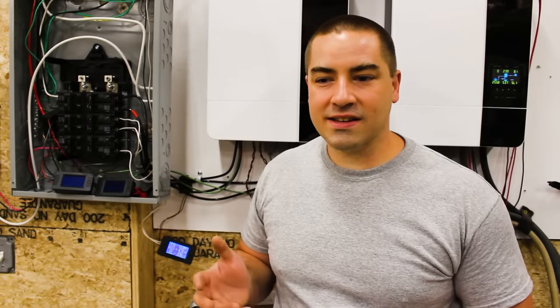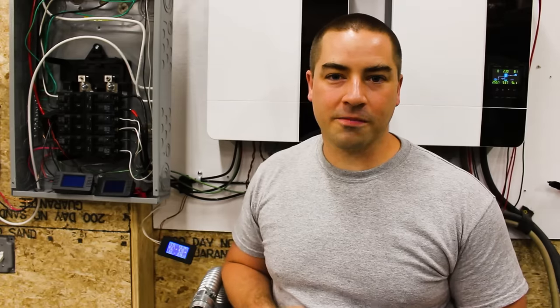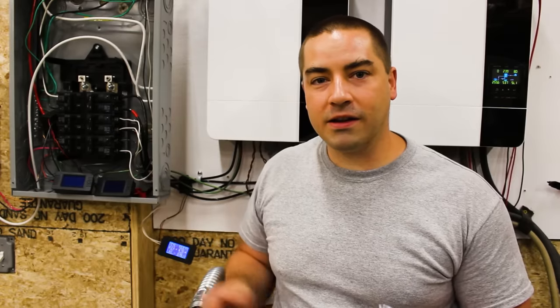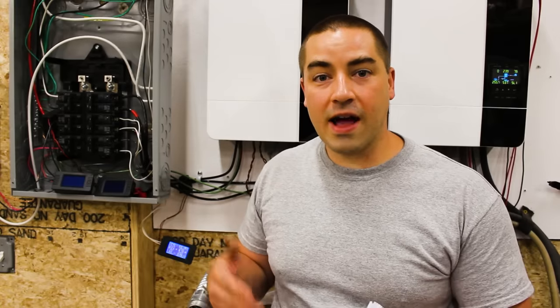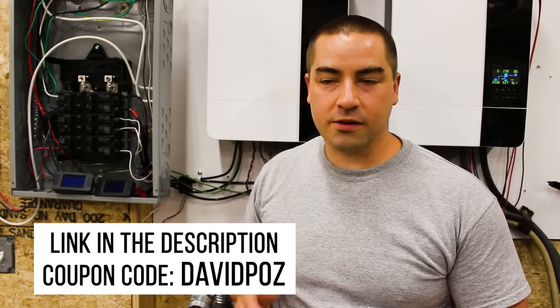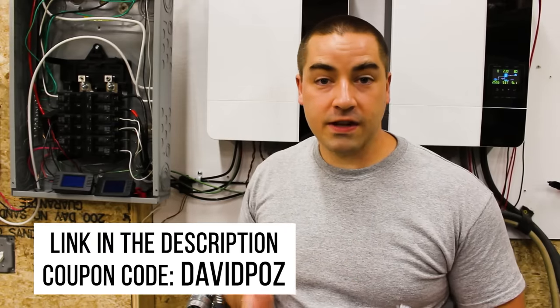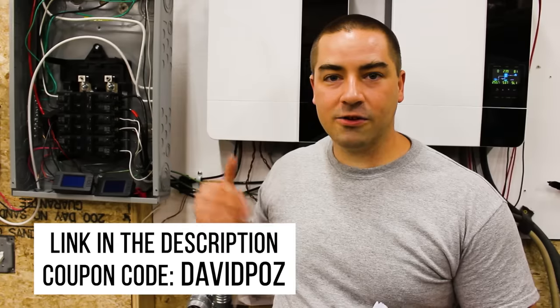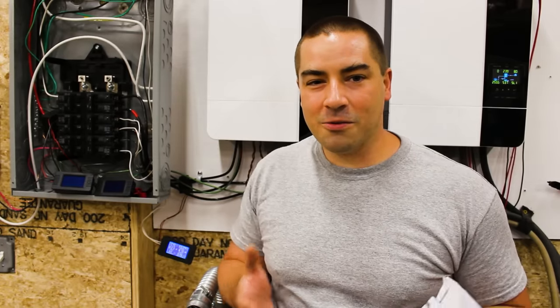Part of why this is so exciting is, let's say you're running your whole house on a dedicated 6, 8, 10 kilowatt inverter. And the inverter won't allow for paralleling more inverters, but you want to increase your capacity. What you could do is move your mini splits or add mini splits to replace your current heating system or cooling system and move that onto a dedicated loads panel being supplied by just one of these. It could still feed off of the same battery bank that you already have if it's a 48 volt battery bank, but now you have the ability to add more solar. You can move those loads off of your main center, and that increases your overall inverting capacity without you needing to kind of totally ditch your existing inverter.